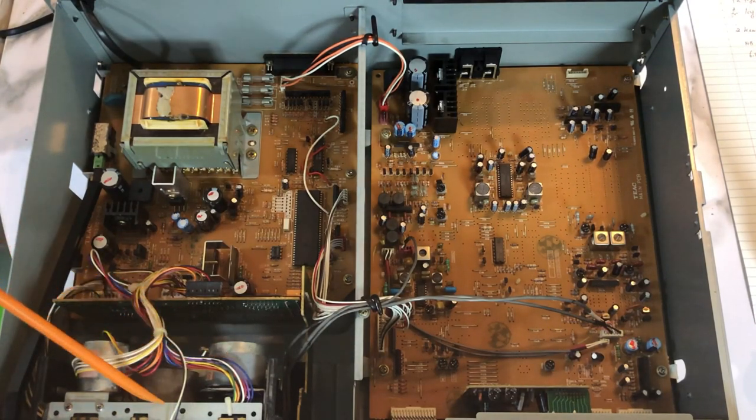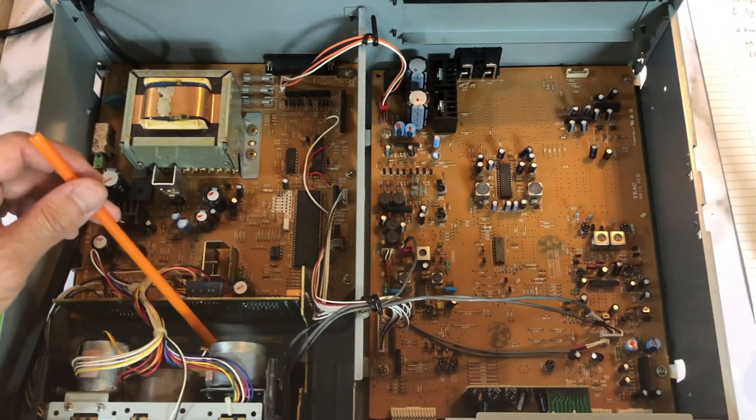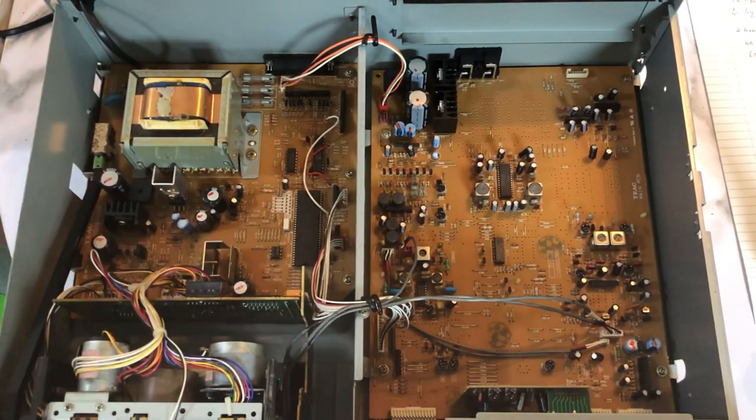And these are the three motors. This is for the capstan driving with a pulley and a flywheel here, connected with a belt, so there's one belt. And this is for the capstan control, and this is for the reel control, and this is auxiliary. So these are the sensors for the selection of tapes, because this is a studio. So the tape selection type 1, type 2, type 4 has to be auto select, to minimize the operation and minimize the mistakes.